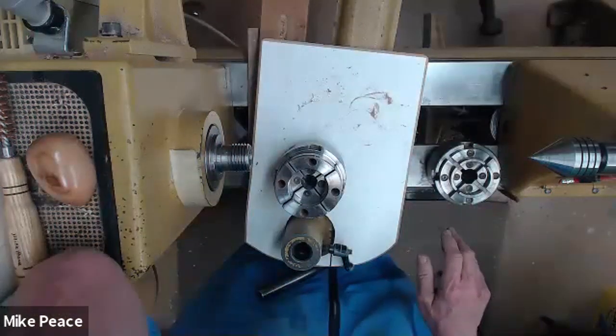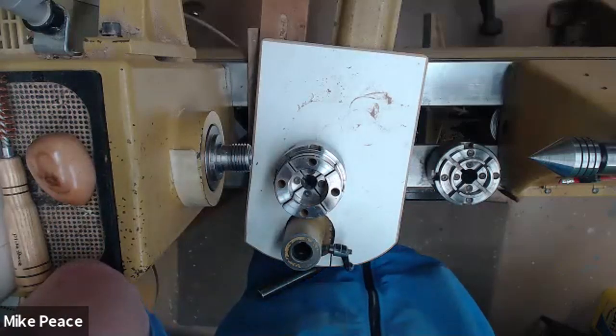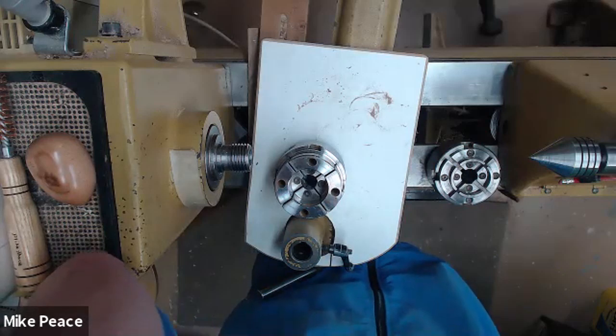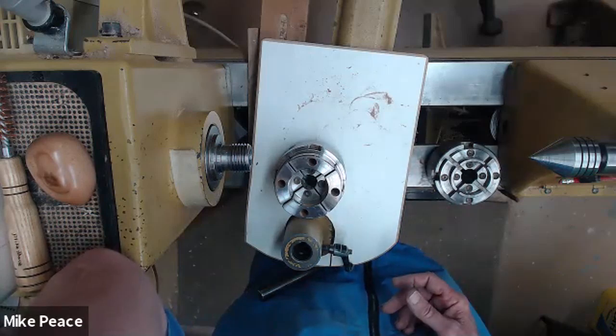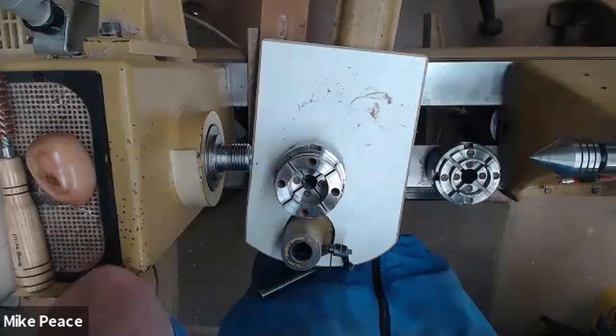And that sounds awfully basic, but I was assisting Harvey Meyer in a workshop, and he had Nova chucks, and he mentioned the word dovetail at least once. Everybody in there was using a Nova chuck with their standard jaws, and we were using a tenon. Because he used the word dovetail at one time, but he told them to make a parallel tenon, 2 out of the 8 people in there made a dovetail tenon because they didn't understand what he said.